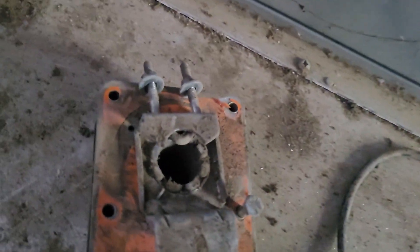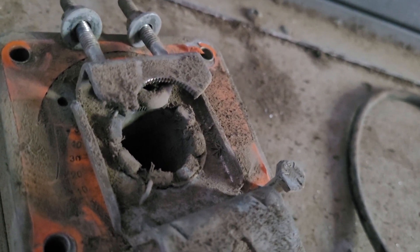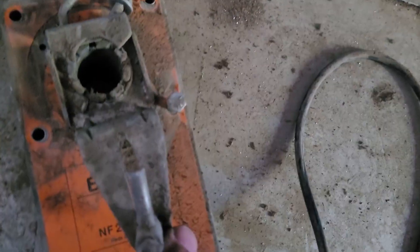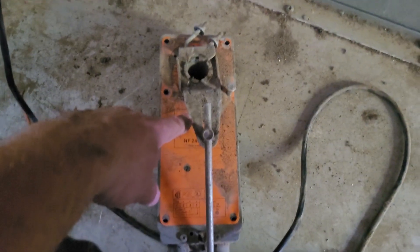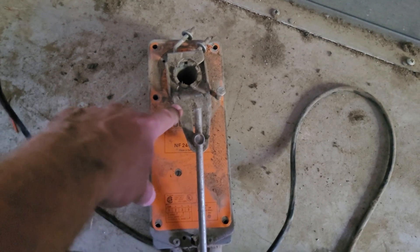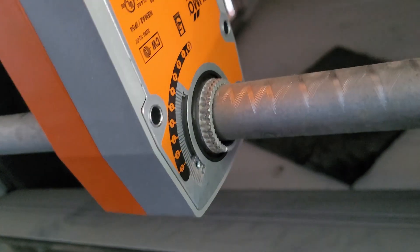They use a crank arm, and you can see how that crank arm looks kind of like a castle — I call that a castle nut because in automotive that's what a castle nut looks like. Belimo makes two styles: they make the style with the splines, which is the AFB style, and they make the style with the castle nut. So this is like a KHAF or even an NF. Same thing — KHAF uses the castle nut, and the spline-style crank arm is KHAFB.